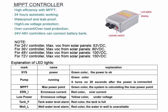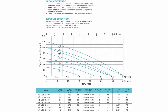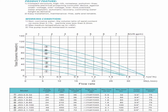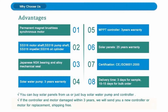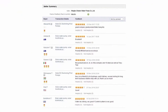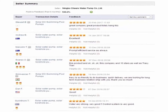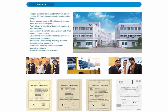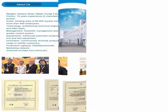Water shortage sensors are included so the pumping system can be fully automated. With sensors installed, the well pump will switch off if the header tank is full or if the water source has fallen below the pump intake. MPPT Controller: drives the high-efficiency brushless DC pump motor, utilizing the latest MPPT technology to ensure maximum flow under all light conditions. It also protects the pump from frequent start-up in low light, overheating, and running dry. 100% satisfied service — any quality issues will be resolved within 24 hours with replacement paid by the company.